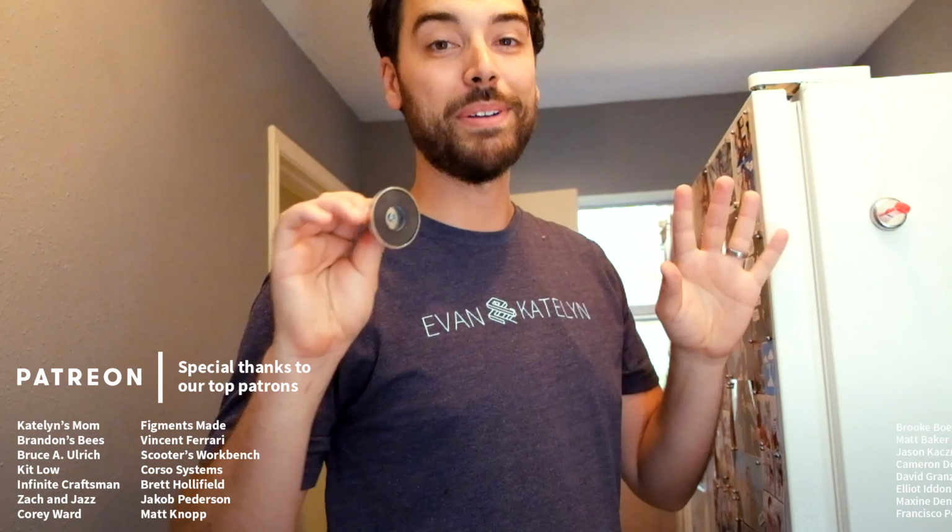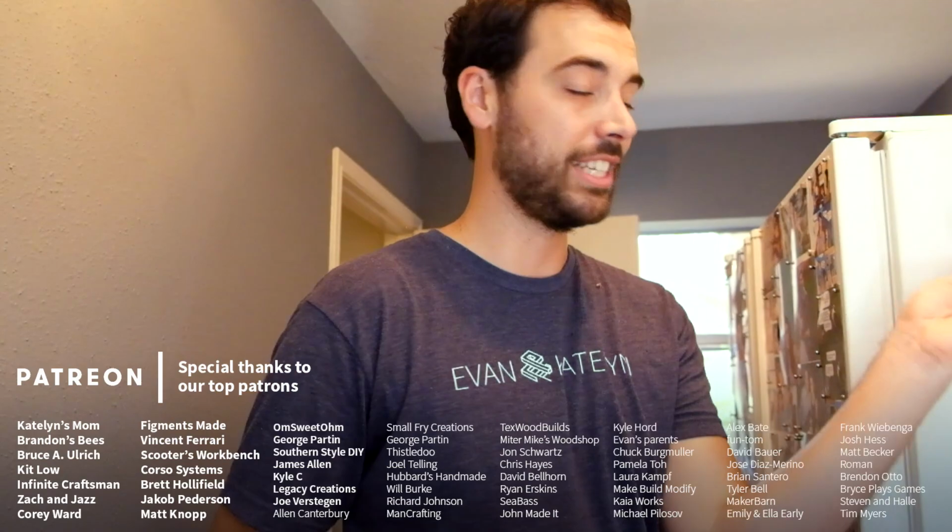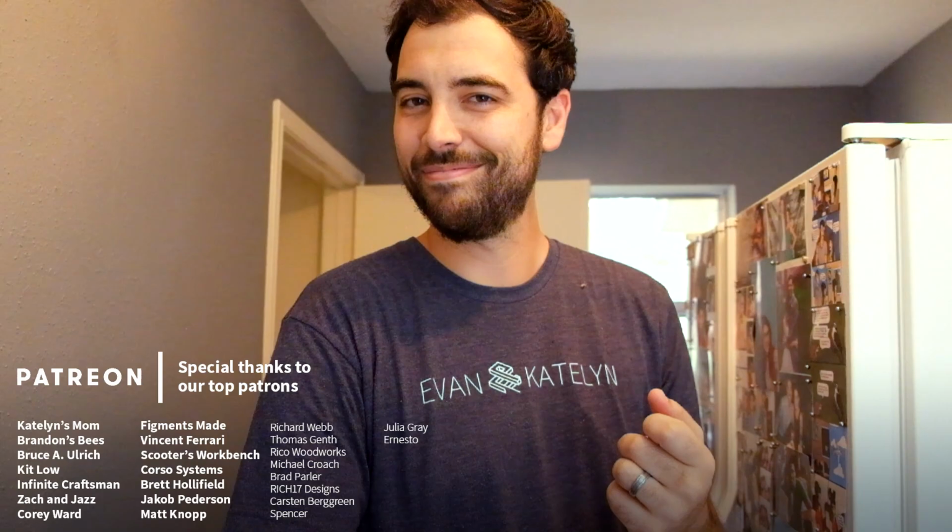We probably spent way too long on this whole magnets thing, but it just goes to show you, test, don't make assumptions. Because I thought that this 70 pound neodymium magnet would totally outperform this 35 pound ceramic one, but the ceramic one is better in this circumstance. The more you know. You ready for some CAD?